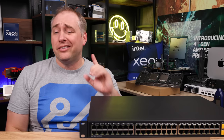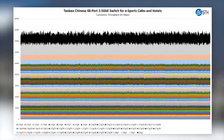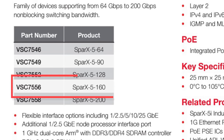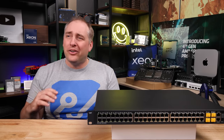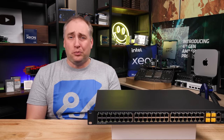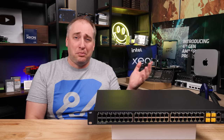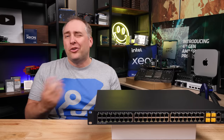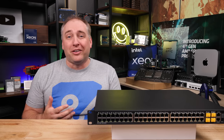I want to quickly talk about performance. We didn't get the full 190 Gbps we'd expect; we also didn't actually achieve the chip's rated 160 Gbps — we got a little bit below that. So the switch isn't doing line rate on all ports, which is kind of a bummer. On the other hand, for a ~$400 managed switch, the fact that it's pushing this much traffic is pretty good. For an eSports cafe, you're probably not fully saturating this switch all the time anyway — they're likely a bit internally oversubscribed by design.